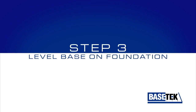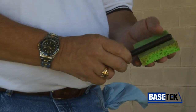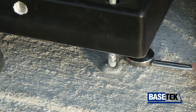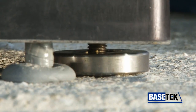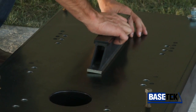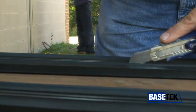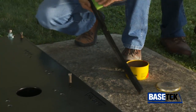Step 3: Level the base on the foundation. Start by waxing the leveling jack bolts, then insert the bolts in the base. Be sure to place a jack pad under each leveling bolt — this provides a solid surface and distributes the load. Note the jack pads are round with no stress-inducing corners. Place a level on the base and adjust the leveling jack bolts until the base is level in all directions. Then hand tighten the anchor bolts. Install required expansion or control joints per grout manufacturer's recommendations.